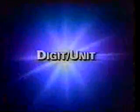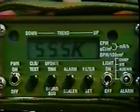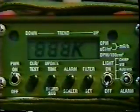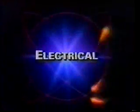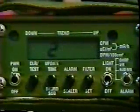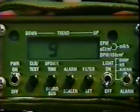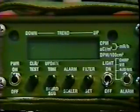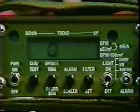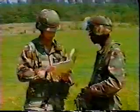The digit unit test begins with three zeros and sequences through numbers, decimal places, and dose units to test that they are all working in proper order. The electrical tests begin immediately after the 9, 9, 9, K display. The one-digit codes which are shown do not pertain to the pre-operational test and can be ignored. The flashing 9 with a pulsating alarm indicates all tests are a go. A flashing zero at the end of the pre-test or during operation indicates a problem. Note: any time a flashing zero is observed, turn off the radiac meter and report it to your supervisor.